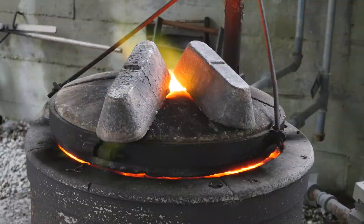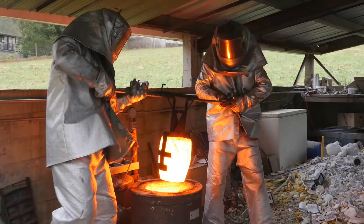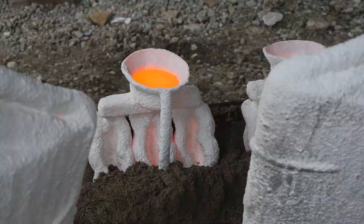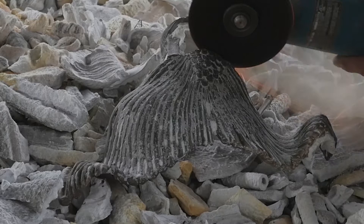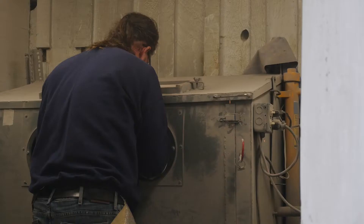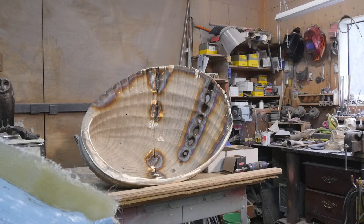We're all wearing special spacesuits so that we're not getting burnt. The bronze is melted and heated to 2,000 degrees and then we pour it into the ceramic vessels, filling them right up. Within about 40 minutes the bronze starts to cool. When it cools we're able to smash off the ceramic mold, and what's revealed is the bronze — it has now substituted where the wax was. We cut off all the sprues and channels, put the individual pieces into a sandblast machine, and clean off all the ceramic residue.